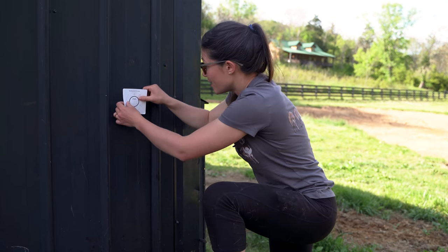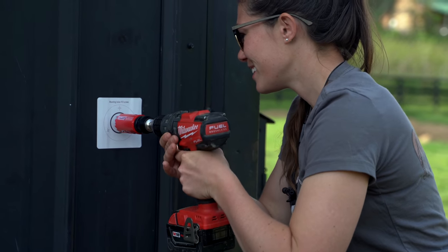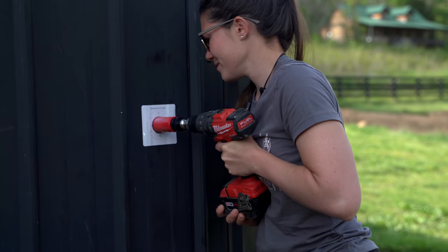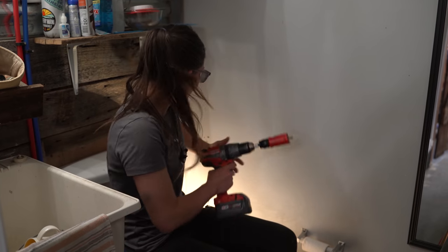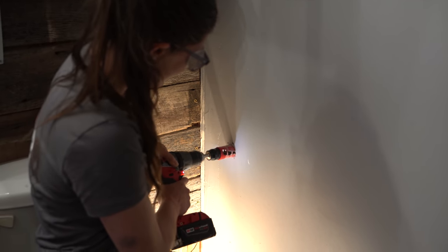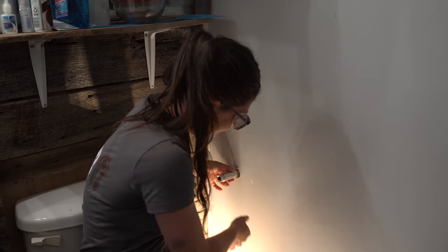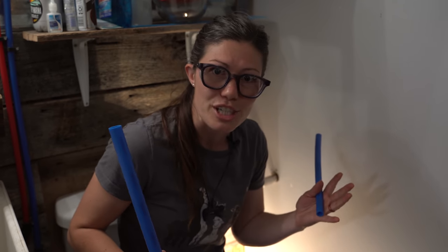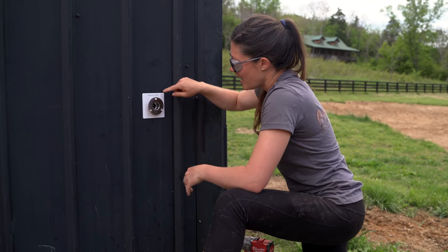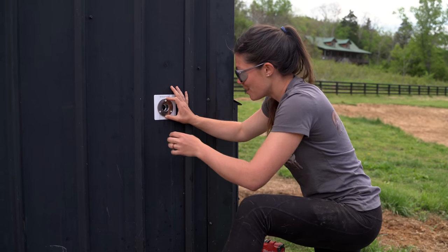Aqua couldn't have made these things easier to install. I'm going to use a hole saw to cut out the side of the barn. I made sure that there was no wires, water pipes, or anything else important behind this. Once I've drilled from the outside wall, I can locate my hole on the inside wall and drill here as well. You poke the nozzle through from the outside and locate it inside. Because I'm going to be remodeling this bathroom soon anyway, I'm going to use PEX tubing with push-to-connect fittings because they are reusable and therefore changeable.